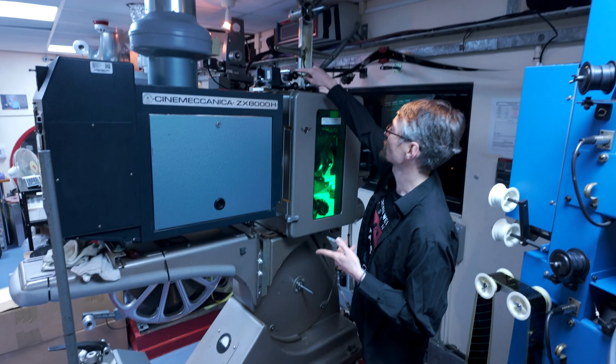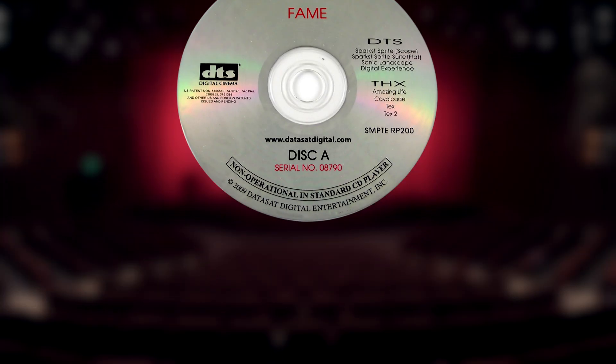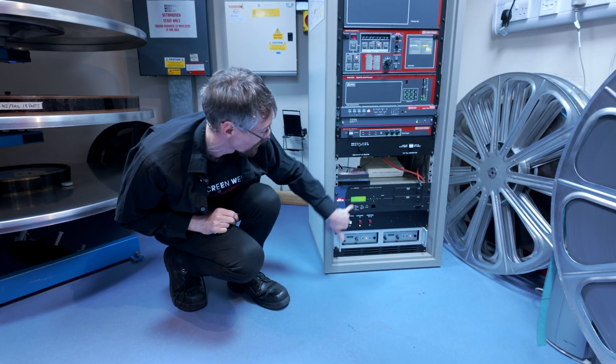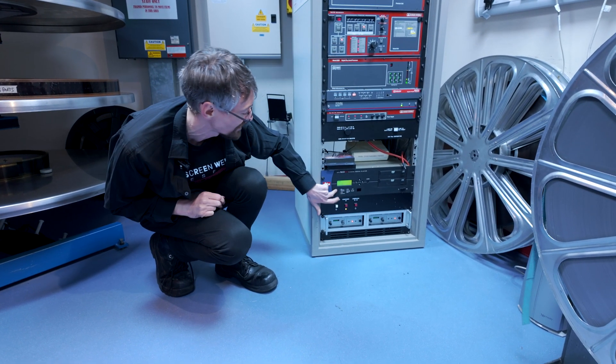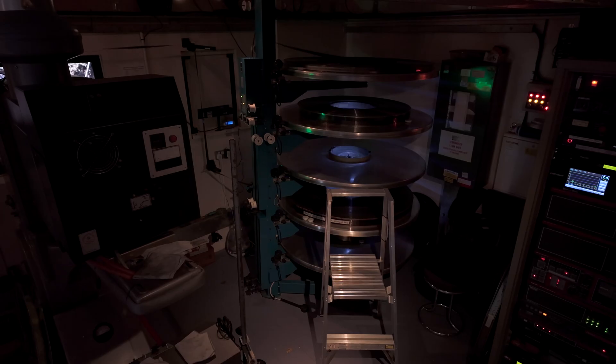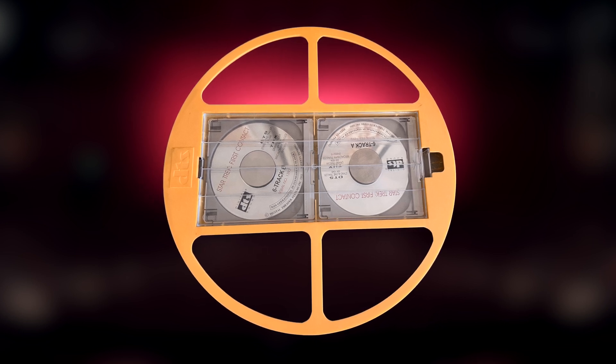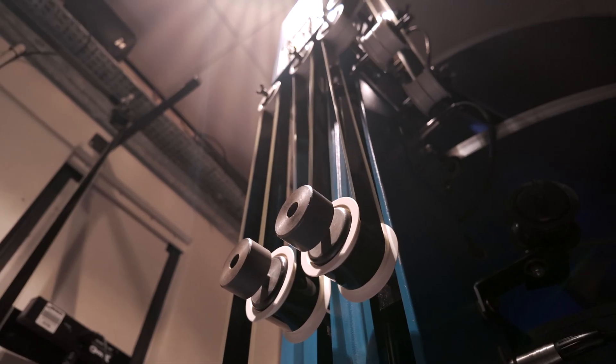The sound is not actually on the film — all this is is a timecode reader. On the film itself you can see the dots and dashes up the side of the perforations — that is the DTS timecode track. The actual audio comes on a disc and is loaded into the processor from a DVD-ROM into the hard drive, and that's where the sound will actually play back. As an interesting fact, DTS provided a special holder that securely held the DVD, designed to fit inside the 70mm film can, ensuring that the soundtrack and film arrived together.